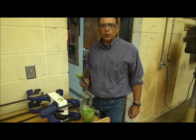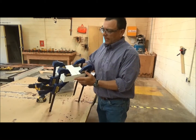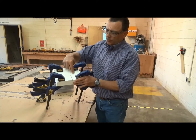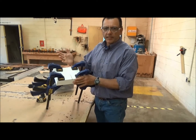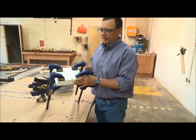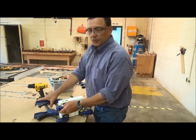We'll have to let this cool about five minutes before we pull the molds apart. On this mold block, I modified it a little bit — I drilled holes in the ends of the tail so that when I make the shot, it goes all the way through the cavity and ejects out the tail, and that's how I know it's full. I made a couple of shots and was having trouble with the cavity completely filling. So I'll go ahead and open the mold now and we'll see how it works.